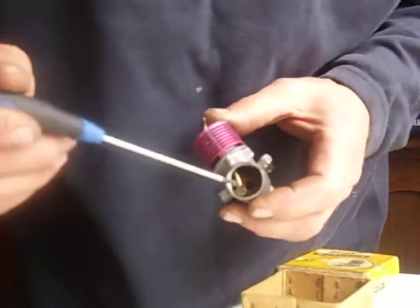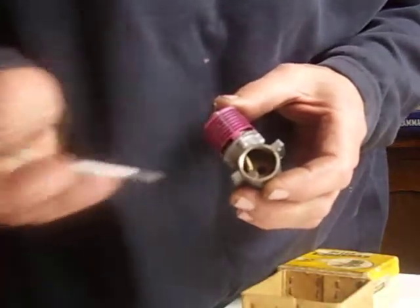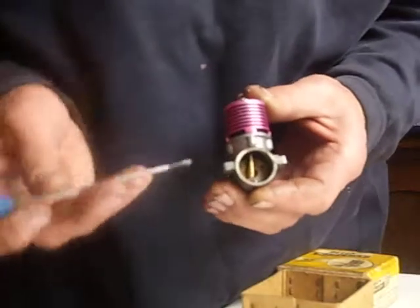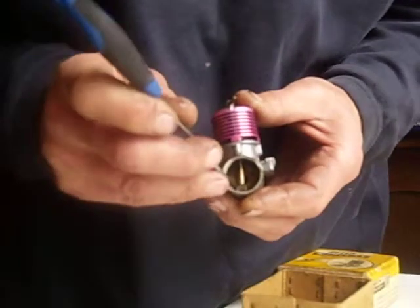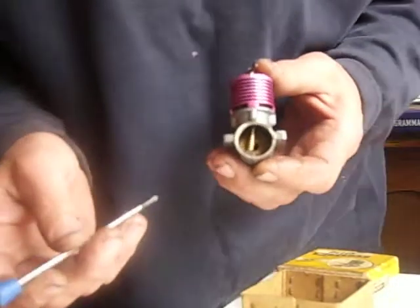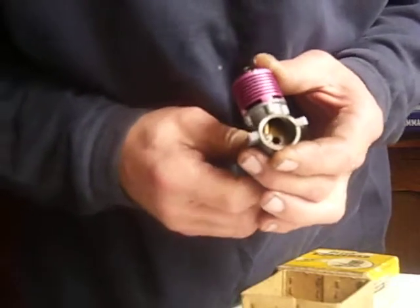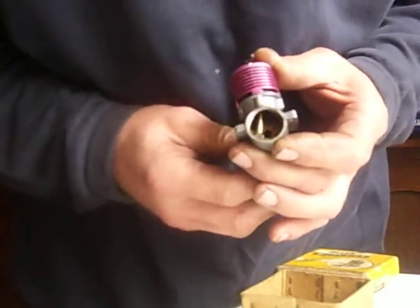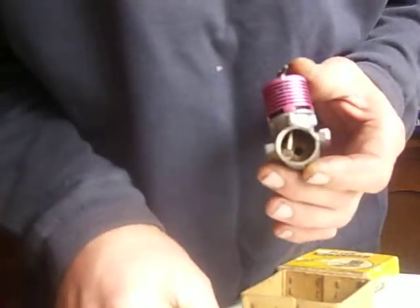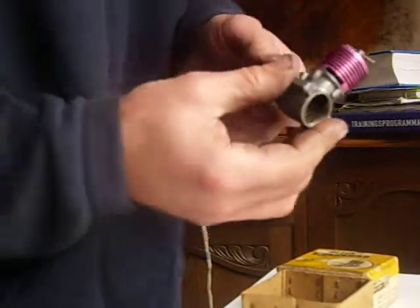Making a bronze bush will not help because material gets too thin here. So I will make a new Conrod and a bigger end outside so I can make a bronze bush and a lubrication hole, and this should help to keep it running well. But if you run this engine, it will still run, but I think after a short time material will get so thin here and one day it will break. And then this means the end of the engine, if you destroy the crank case.